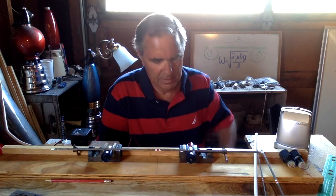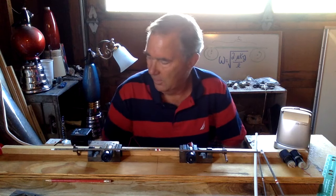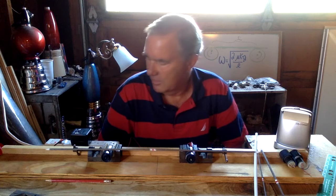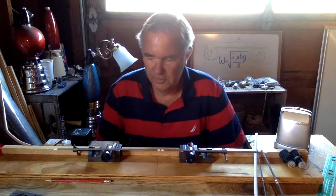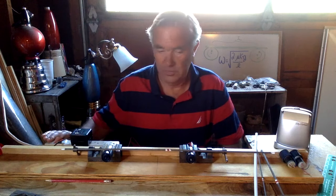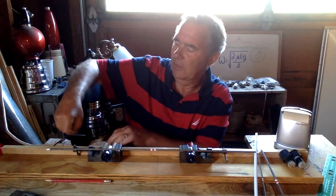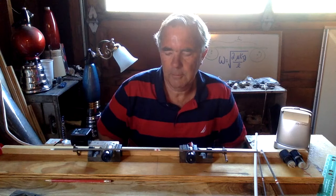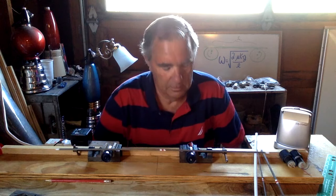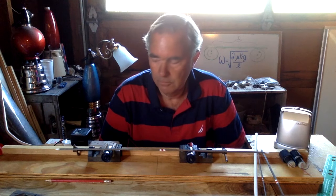They're normally powered by a pair of 1.5 volt batteries in series. I've got them powered from an adjustable power supply that takes power from a wall outlet. The advantage being that the batteries don't wear out. And this adjustable power supply is convenient for proving that oscillation frequency varies with RPM.